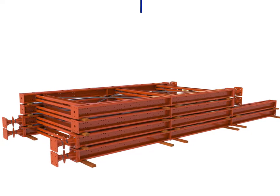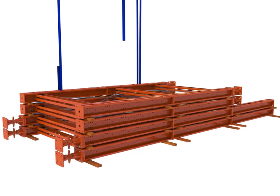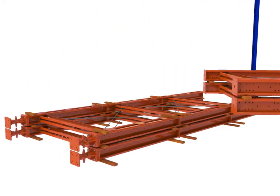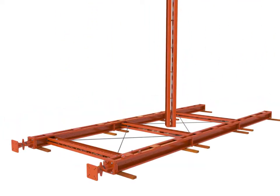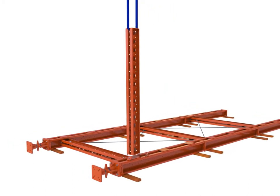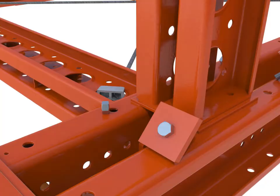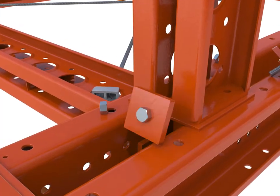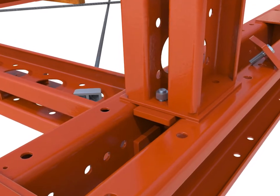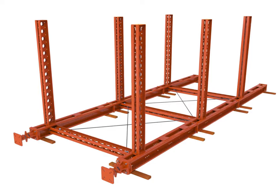One pair at a time, lift the frames into suitable workspaces for the next step of the erection procedure. Starting with the base section of the tower, install the super slim soldier ledgers to connect the two frames together using the same M16x60 bolts, nuts and plate washers as before. For now, leave all bolts loose.